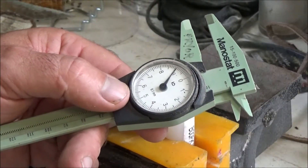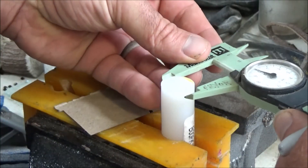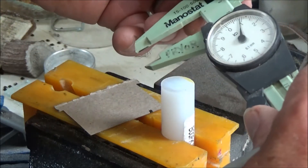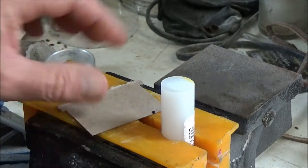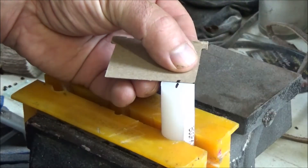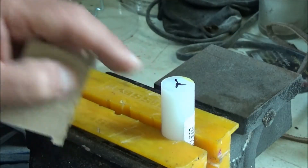I've tried several different ways to figure out how to find the center of the dowel, but the easiest way for me is to take the diameter with a set of calipers. This is exactly 20 millimeters, so I take half of that, which is 10, and then make a little mark on a piece of paper or cardboard at 10 millimeters, and then just start making lines. That little spot in the middle — that's dead center.